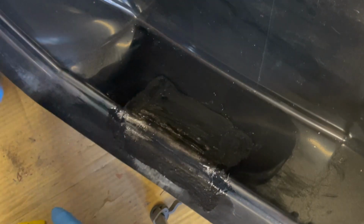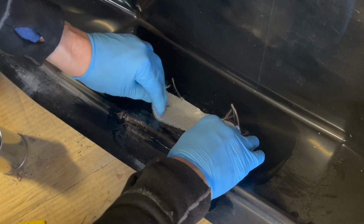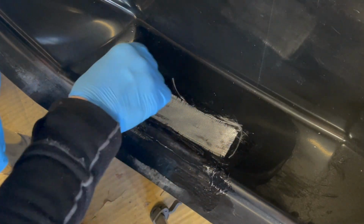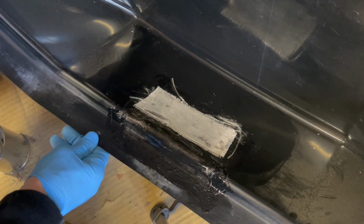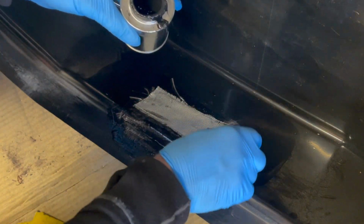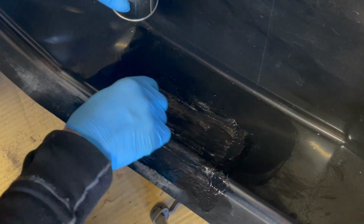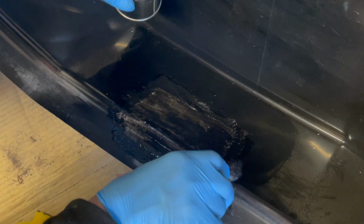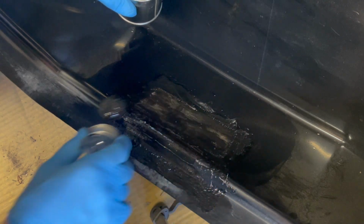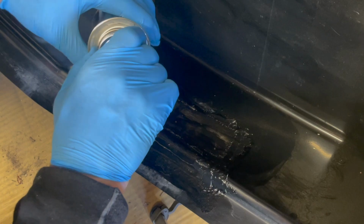Any repairs you do on the outside shouldn't go in the sun for, I would say, 2 to maybe 3 days, just to let it off-gas naturally. I can't stress enough that we don't want to expose this to the sun right away. It needs a little bit of time to cure. So we're getting towards the end on this repair. Tomorrow we're going to come in and put another coat on. About 8 hours after that, we can drill the holes back through, rivet the piece back on, and reassemble the box.